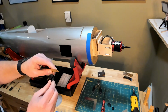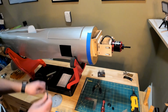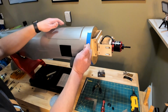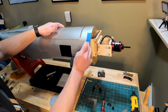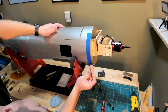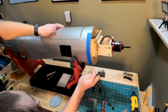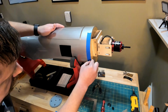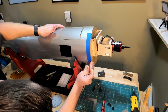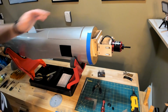And so what I do is I cut pieces of cardboard for this when we're fitting these holes for the cowl. I like to use the cardboard from like pop 12 packs or whatnot, and you can see I was using a piece of cardboard from a Coke Zero. But what I do is through that blue tape, I find the holes with the blind nuts that are already in the fuselage, and I just have a drill bit. I'm poking the hole here. I have already poked the same hole in those pieces of cardboard. So I have 4 pieces of that cardboard.